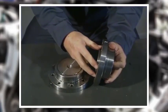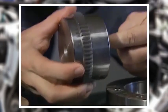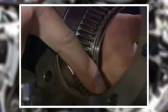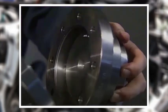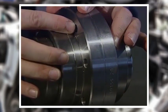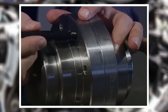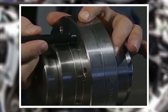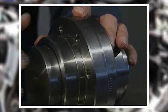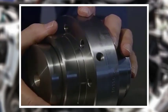Another common type of flexible coupling is the gear coupling. Each side consists of two parts: one part is a gear mounted on the shaft, and the other part — a cover — has internal teeth that mesh with the teeth of the gears on the shaft. The two halves are bolted together to assure correct alignment. The gear coupling can also be assembled with shear pins between the halves. Applying too much rotary force or torque shears off the pins, allowing the coupling halves and attached shafts to run free.